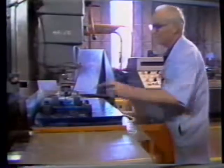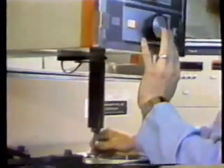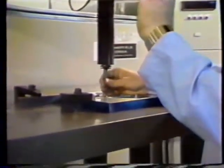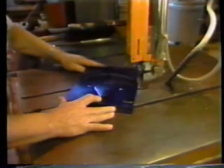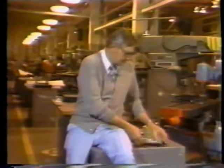When all cutting passes are made, the freshly cut form is pulled off the machine and passed on to the next phase of operations, where it is checked for accuracy of milling. If the model passes the battery of measurements, holes are bored where needed to facilitate mounting later in the wind tunnel. The model is then cut out of its holding pieces. It is a skillful, steady hand that shapes the airfoil or wing section of the model. When the model is polished and it passes all final specification checks, it is ready for testing in the wind tunnel. Senior aerospace technologist Bernie Spencer.